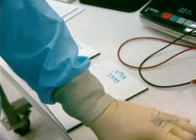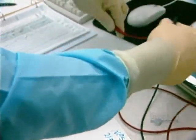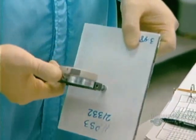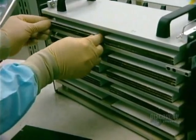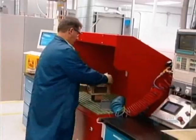Here a test is made. Using a voltmeter, the battery is checked to see that it produces the required 3.56 volts. Any problem can be detected here and corrected. A final quality check is made with a caliper, which precisely measures the thickness of the battery cell. The battery cells are then stored, with metallic plates placed between them for the entire storage period.